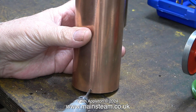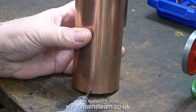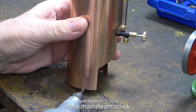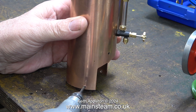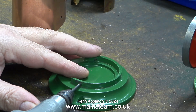The job starts by enlarging the holes in the boiler barrel where it bolts to the base. The original bolts are quite small. I'm going to increase the size to 4BA, enlarging the mounting holes to 1/8 of an inch in diameter. Then I will use these holes as a guide to also drill through into the cast alloy base — that's what I'm doing here.